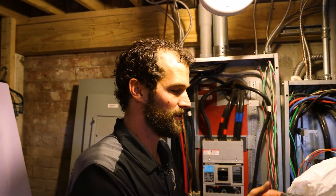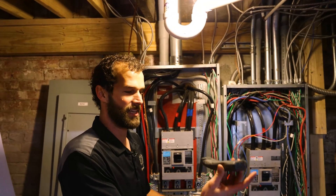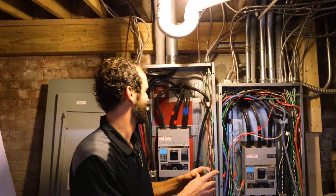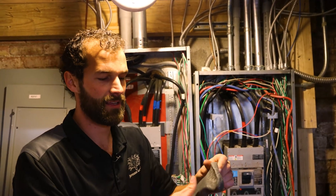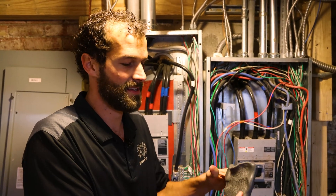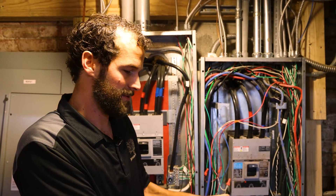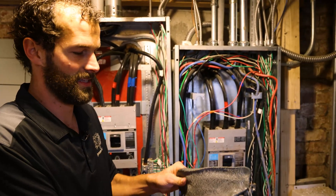Here's option two — the better option. It costs a little bit more, takes a little bit longer, gets you a little bit dirtier. But this duct seal — I love this stuff. It's been in a warm environment, so it's soft and malleable. If it's been in your truck and it's sub-freezing outside, this stuff is going to be really hard to work with. So throw it in the dash, warm it up, soften it up. Stretch it out — back to kindergarten, boys. Let's work it.